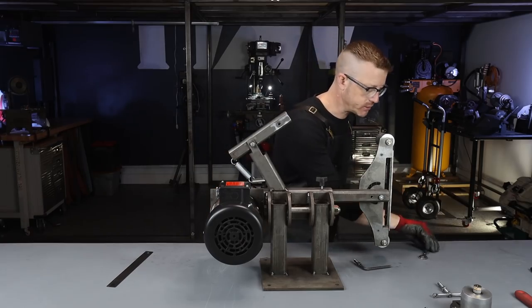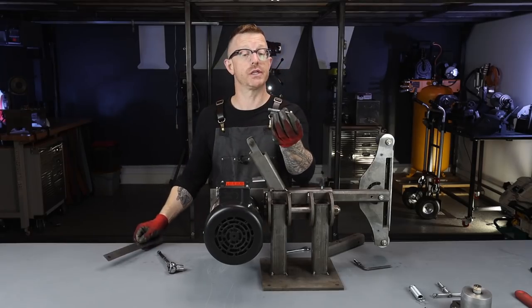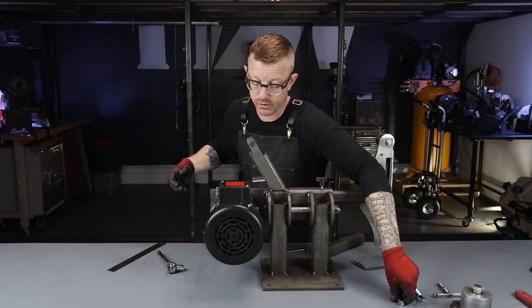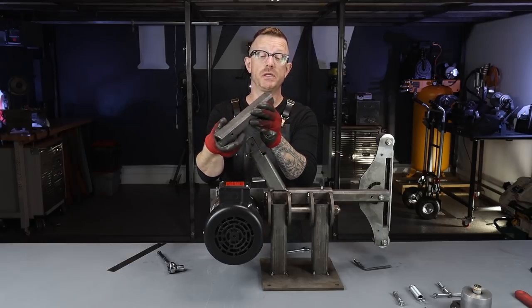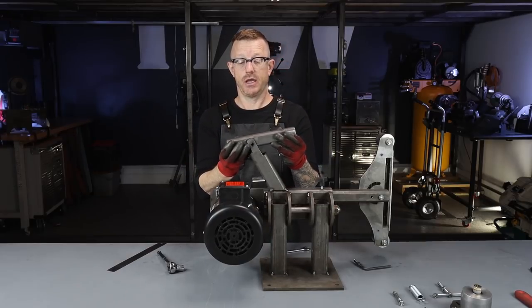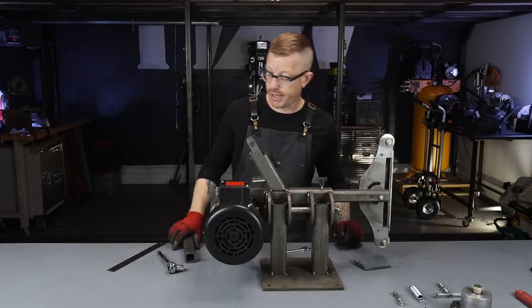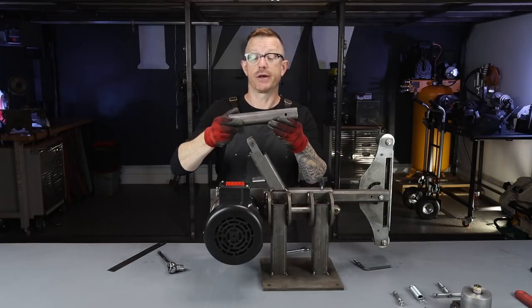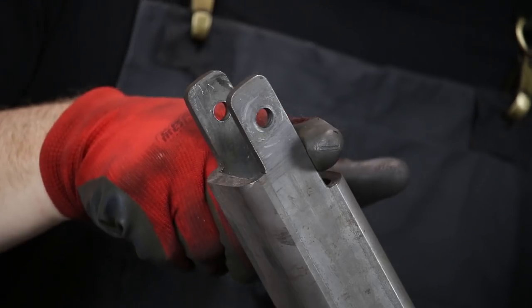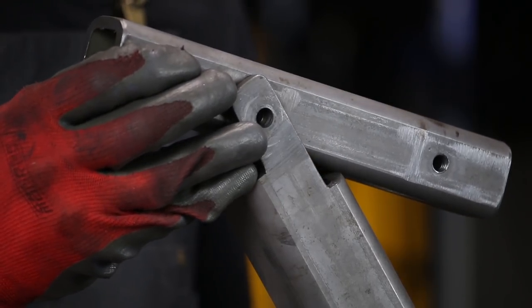Let's take it apart so we can see how it's constructed. The bolt is just a standard two-and-three-quarters inch, three-eighths inch bolt — a standard nut and bolt; probably good to put a lock washer on there. You can see this is a very simple setup: a nine-inch piece of tube steel with a couple of holes drilled in it. The fulcrum bolt is set a little bit lower, not on center, and the reason is that it allows this arm to tilt just properly. Plus I wanted the holes in the tensioning pillar to be a bit lower down so they weren't as close to the top of this bracket — if it sits down like that it's a little bit more stable, you've got a little more meat up here.